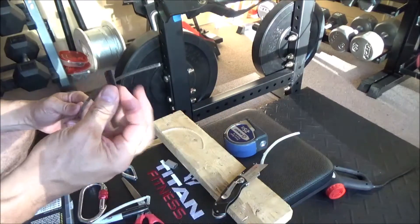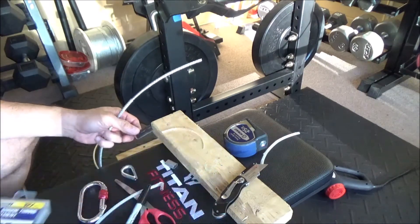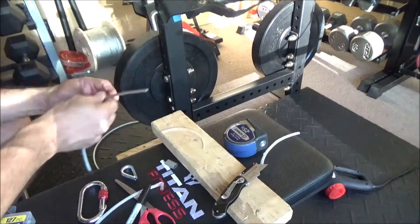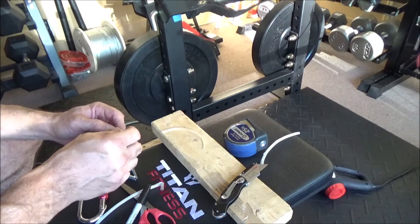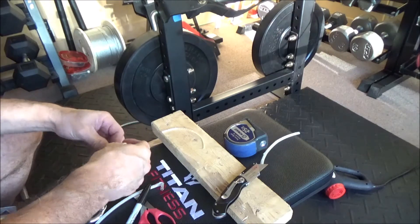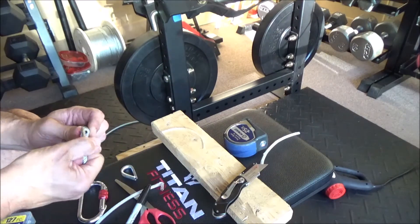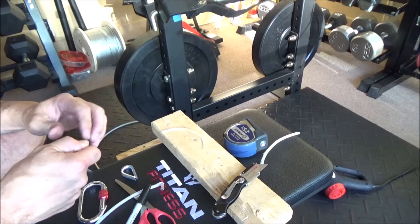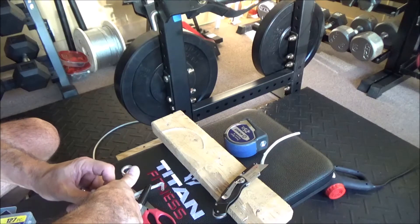I'm also going to put on some shrink wrap from this assortment of shrink wrap tubing from Harbor Freight — it's the half inch diameter. This is where you really need to have a very clean end, or else the stuff you're going to do won't work out. This has very small holes; it will barely fit over the end of the wire rope. Once I have it through once, I want to push this all the way to the end, then curve it and push it through again. I can see it's already starting to splay — if it gets to a certain point, I can't use this end.